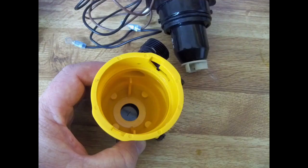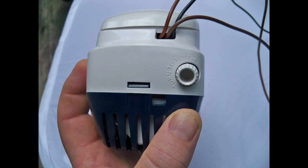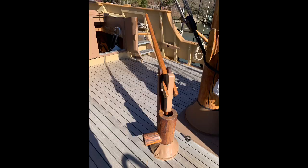If your boat has an inaccessible pump, relocate it for better access. Tip three: disassemble and inspect pumps periodically for worn or damaged components, paying particular attention to neoprene or other soft parts such as diaphragms and check valves. This is not only good preventative maintenance, but it also lets you learn the ins and outs of disassembling and reassembling your bilge pumps before an emergency occurs. Tip four: list your bilge pump types, location, and size for future reference and make sure there are extra spares on board or complete rebuild kits for each. If you really want to go the extra mile, pack a complete spare bilge pump assembly so you can quickly swap out a defective pump and repair it later at your convenience.